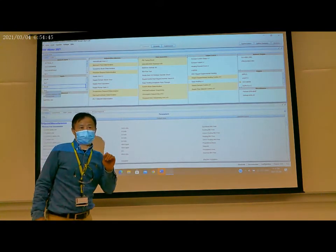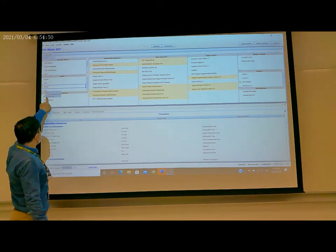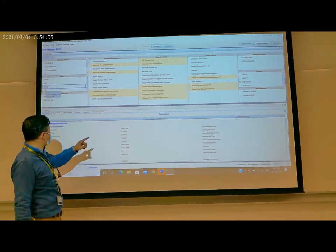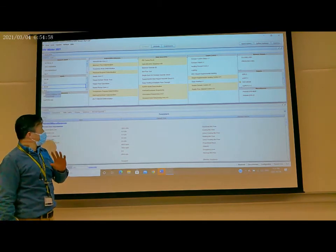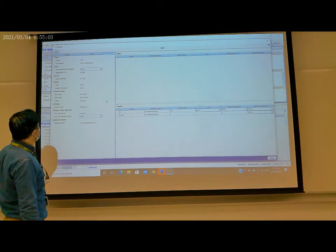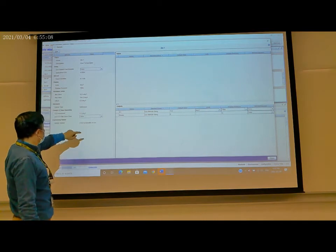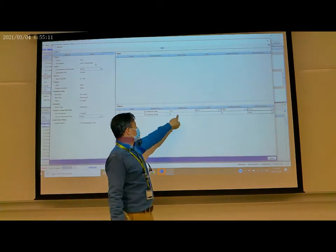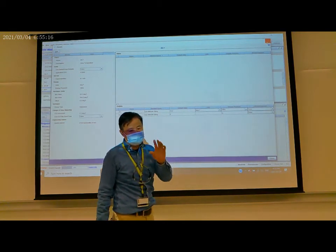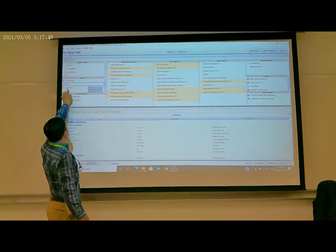This is the thermostat sensor, it sends the room temperature. This signal is from SA bus, so it's from the thermostat. So for this one, the signal from SA bus is correct. And then double click. This is the zone temperature, the room temperature. Now the default is 72, it's fine. The sensor will sense the room temperature. Okay, let's check the occupancy sensor.